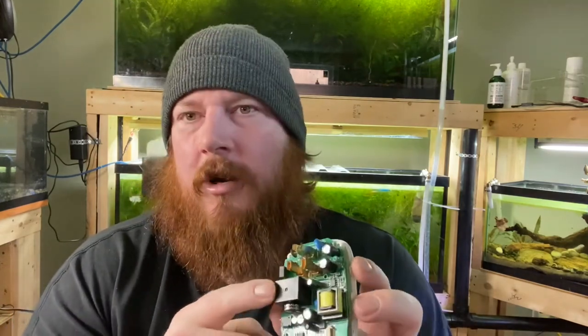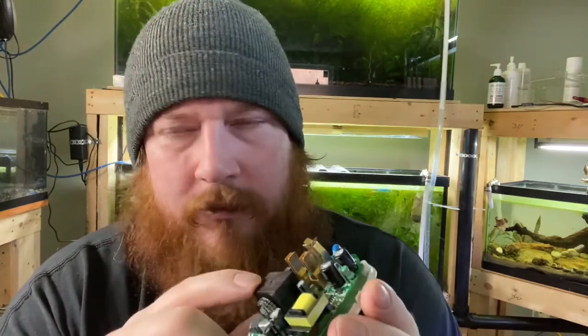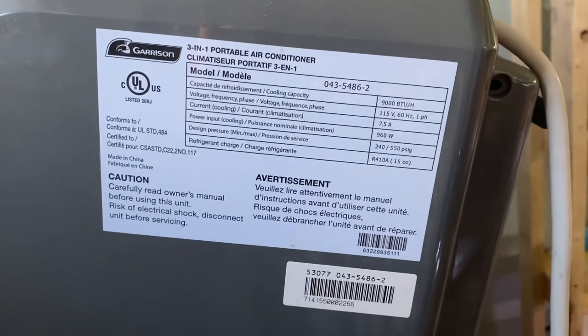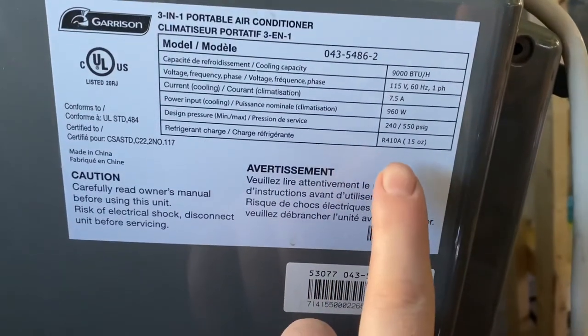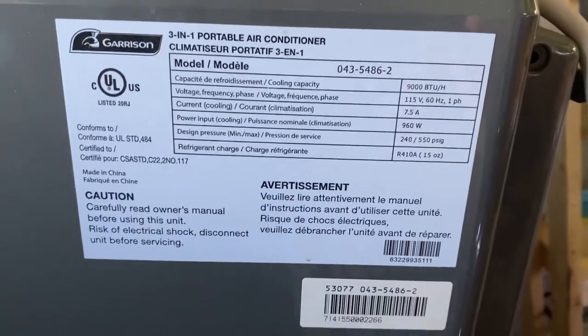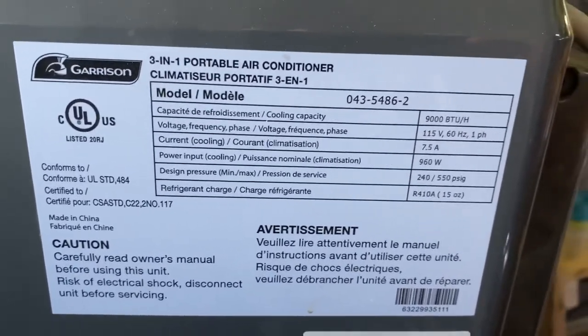And this is the part that I'm gonna call a little contactor or relay. It says it's rated for 20 amps on 125 volts. Well, I misspoke in my first take. I said it is about 1300 watts. It's actually 960 watts, which puts it at 7.5 amps. So that's well below what the Inkbird is rated for.